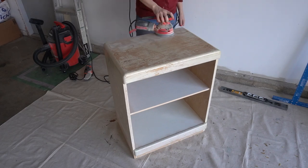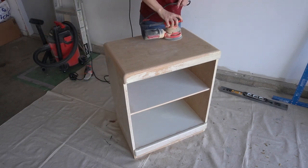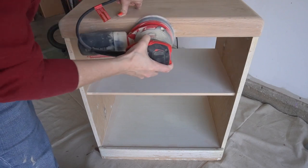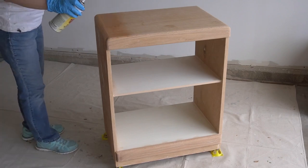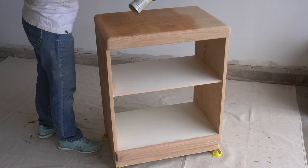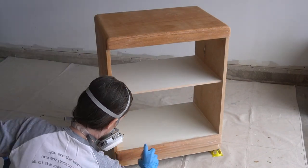Finally it was time to take this thing back down to raw wood. I went from the top down with the orbital sander using a 150-grit disc, and did the corners and smaller areas by hand since the sander wouldn't fit. I knew this piece would be a bleeder, and since I'm using a light paint color, I used clear shellac to seal the surface and block tannins from coming up through the knots. I did two coats on everything except the new shelves.